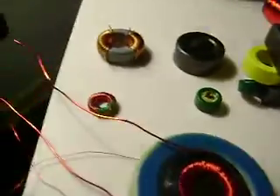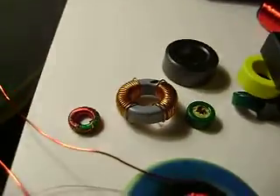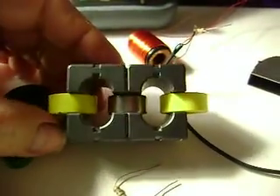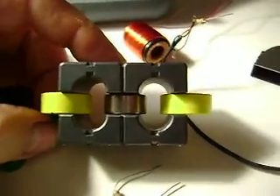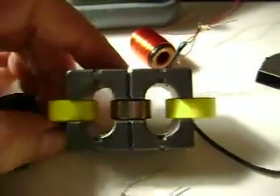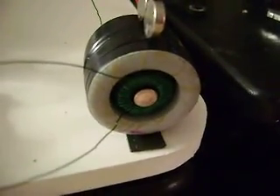With just some stuff you can find, these are some small little toroids — they've got to be cleaned of glue. You can get nice pathways for the magnetic field and just find the right size magnets without having to get any custom-made cores. This was another core I tried where I had the inside wrapped with really fine wire and the outside with thick wire — results weren't so great. I've rewrapped these things quite a bit, but this one is working very well right now, so I'm getting closer. Alright guys, talk to you later.